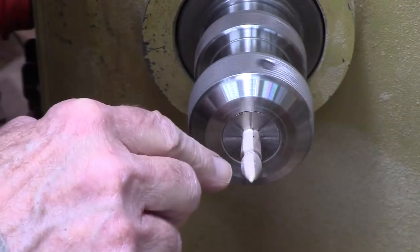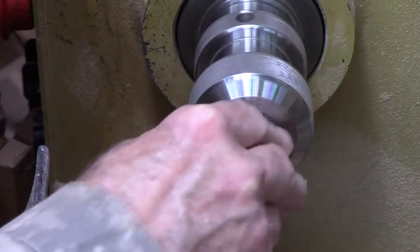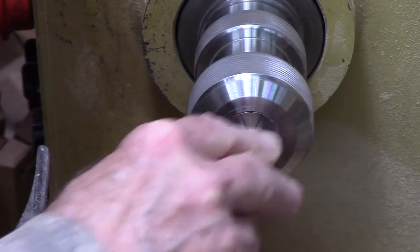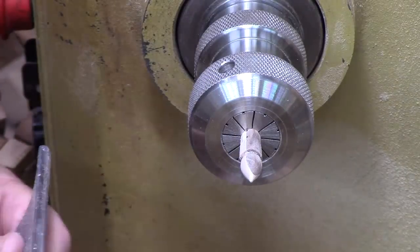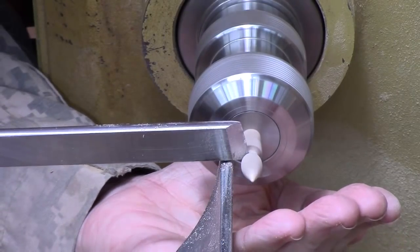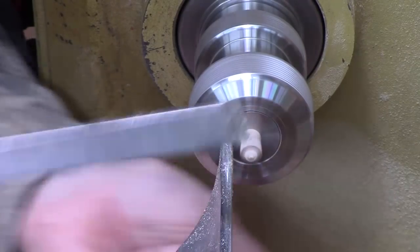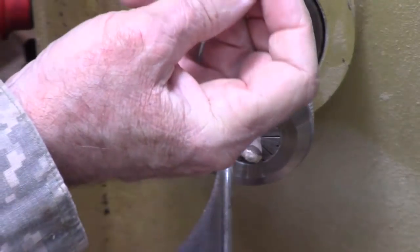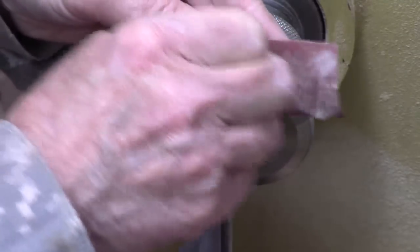And if the wings are not even, it doesn't make a lot of difference. You're generally only going to see one side once you get it mounted on a birdhouse. So, like I say, this lends itself to rough cutting. Just use good carpenter's glue when you glue it up. And then you might have a tiny little bump. You can put your sandpaper and just quickly knock that little bump off.